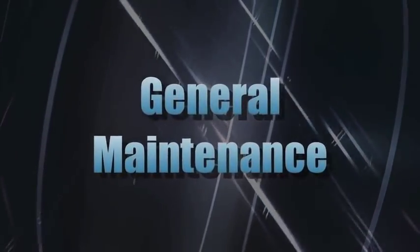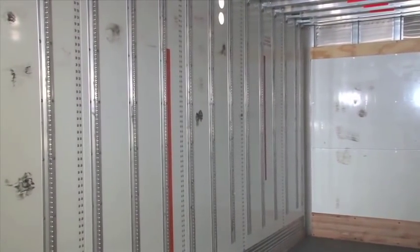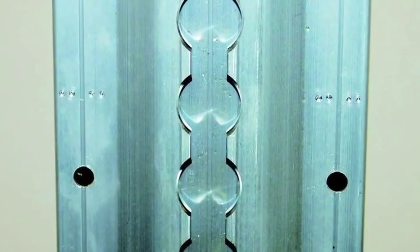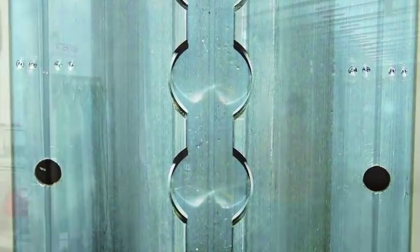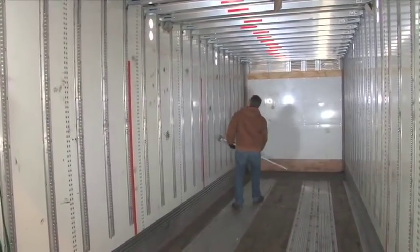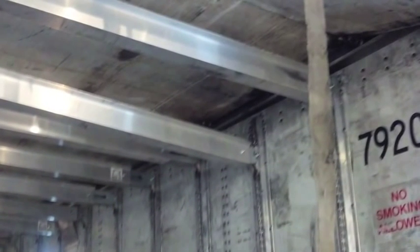Finally, let's look at the inspection and maintenance of the system. The beauty of this system is its simplicity — it's as easy to maintain as it is to use. The decking system is manufactured from precision machined 6000 series extruded aluminum and does not require lubrication or constant maintenance. As long as the system is used properly and kept damage free, Lift-A-Deck 2 beams will continue to slide smoothly with no binding. Before loading your trailer, inspect the track for wear or damage, which may cause the beams to not securely engage the track. Pay particular attention to the track where beams may have dropped from their storage position during transit.